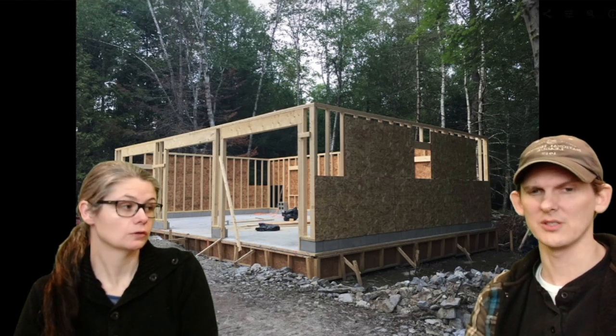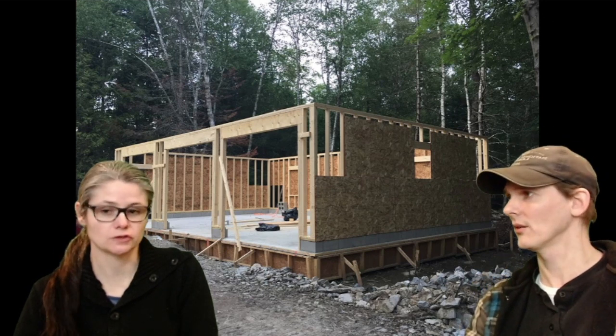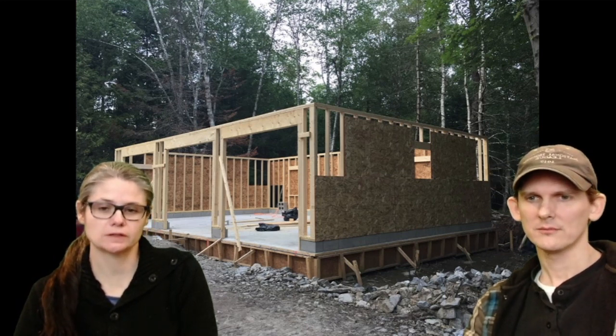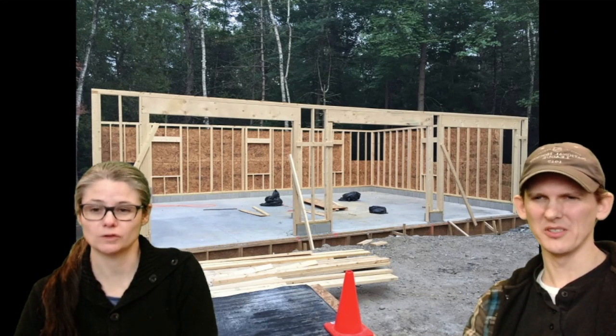But it does have some repercussions: if you get water in there, it won't drain out. So you've got to make sure that you keep water out of the garage. But that's the sheathing. You get the sheathing all the way around, and you can cover up through the windows and just keep going all the way through. You can cut out the windows afterwards, it's so easy to do, and it wastes a little material.